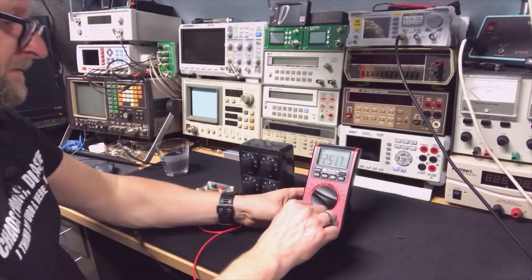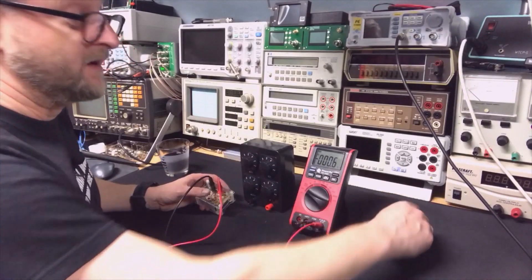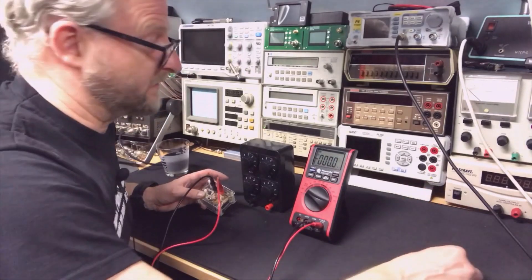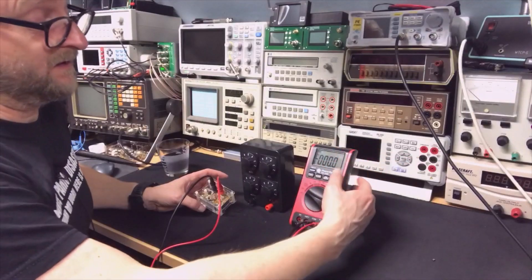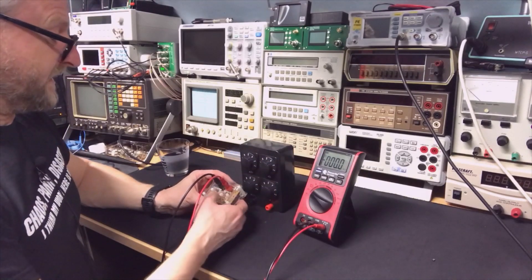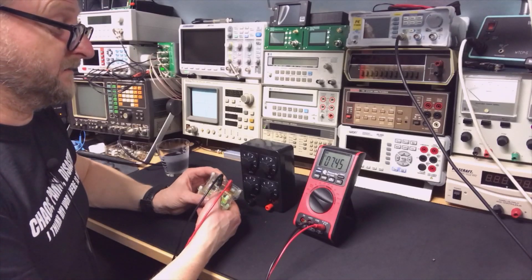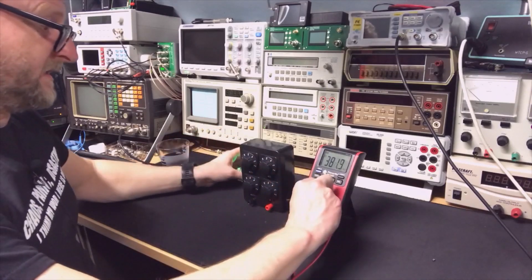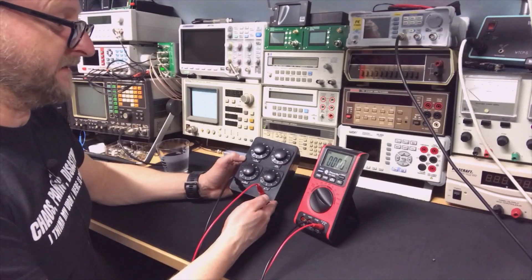Let's try again just to see if it still works after the operation. What we did was actually quite simple: I just cut from the display these little pieces of plastic that acted as spacers. Maybe because the board got old or was a little bent, but now with the spacers removed you can put more force on the strip, and the display works perfectly again. It is auto-ranging — that's cool — and it's quite fast. It's about 30 millivolts off. Let's check the ohms range.